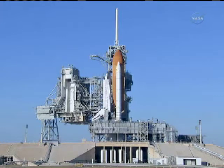We're talking about tolerances in the thousandths of an inch and temperatures down to the minus 423 degree range of hydrogen. So near perfect isn't perfect enough. So we learned quite a bit here, and we believe that we've got a process now. And thankfully, everything's been going extremely smooth today. No indications of a leak so far, and the tank is about 65-70% full now, and we're doing real well. We're real pleased with how everything is turning out today.